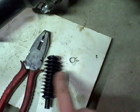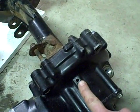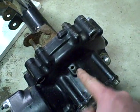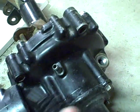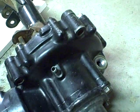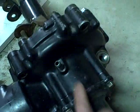This little clamp that came with the bladder is actually too small. When you squeeze it down, it won't go over this flared end on the breather tube, so even if I slide it on ahead of time before I put the bladder on, I can't get it to fit over the OD here. I've got this small clamp which is just slightly larger and that should work — and yes, that size clamp there is a perfect fit. It fits snug, can't get past the flared end, so that's going to hold that bladder on just fine.